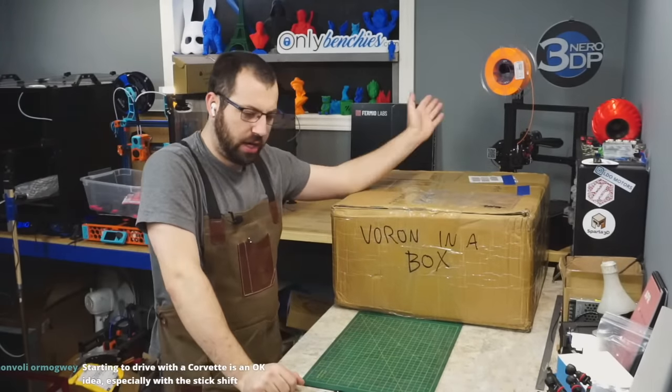How good do these work? That's what I use in all my printers. I made my own Microfit kit. I basically went on AliExpress and bought like 30 of each size, male and female, and I made my own Microfit kit. So I use these in my printers, okay? Downside to them, they do kind of get brittle after a while. So after a couple of years, the locking tabs have a tendency to break off, but they are functional, if you put it that way. So they're good enough. At least they come with the Microfit 3s.